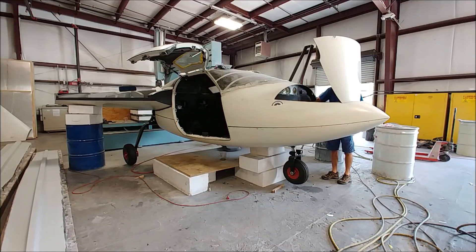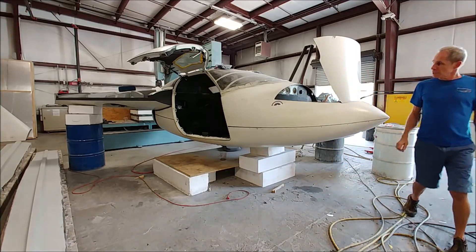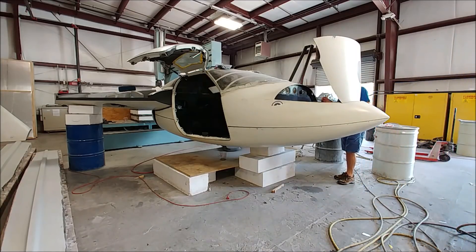There's a lot of background noise in the shop, but it's working fine. The gear pump is probably pushing fluid a little too quickly and you can hear it banging as it comes in, so we may need to put some rubber stoppers on the end. I've also ordered some flow control valves so we can slow it down — dial in how much fluid is moving through the pump and how quickly — so we can get it to work exactly as needed. It has no problem pulling up the gear.